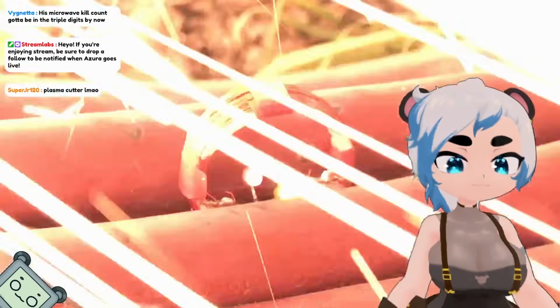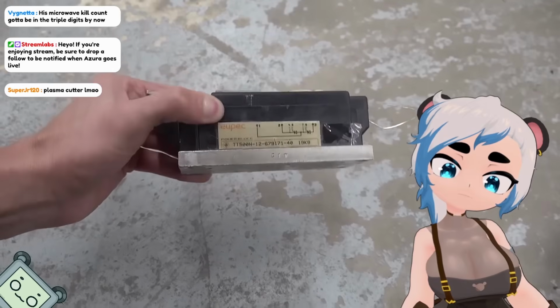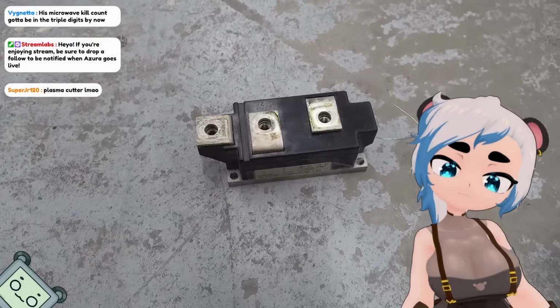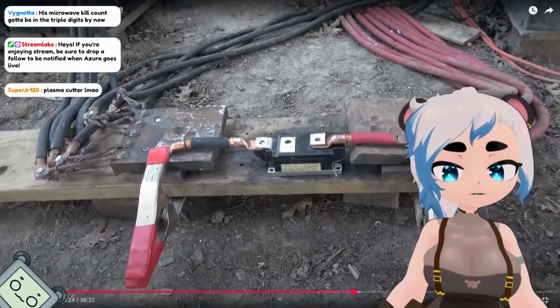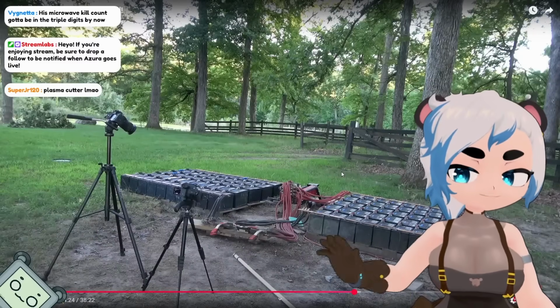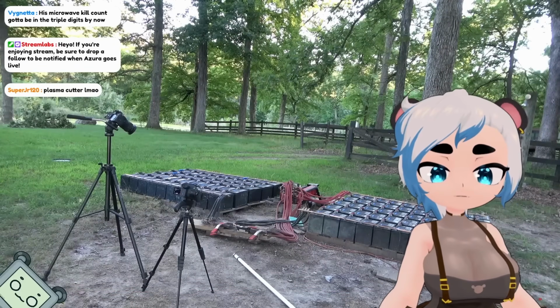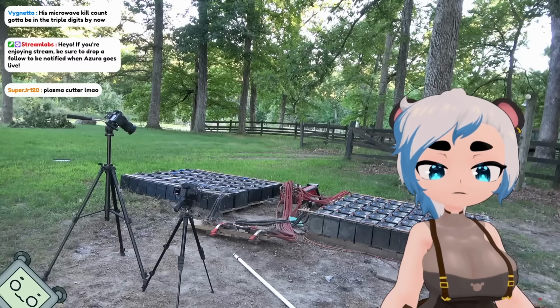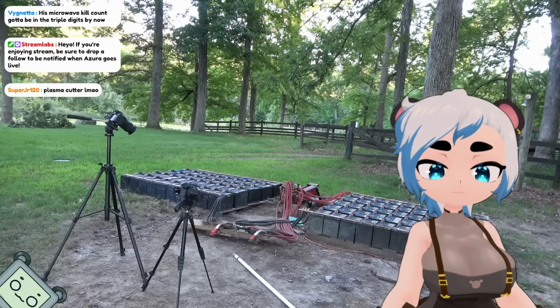Those LEDs are being wirelessly powered by the alternating magnetic field. I have this big old SCR here, which is a type of solid-state switch. I want to try popping it with the batteries. As expected, nothing happens yet because the SCR is off and it holds back the battery voltage.